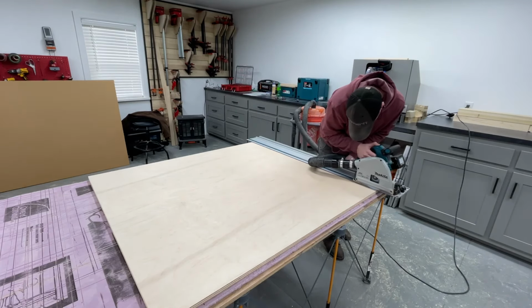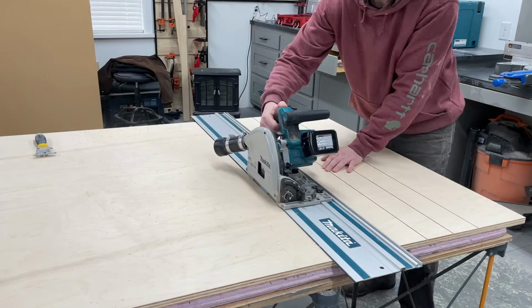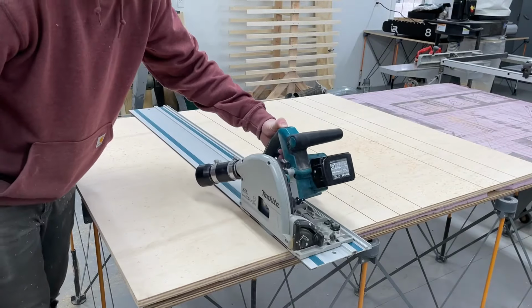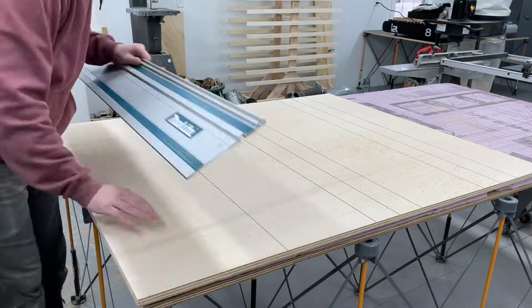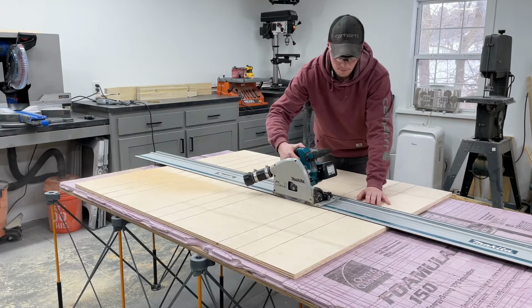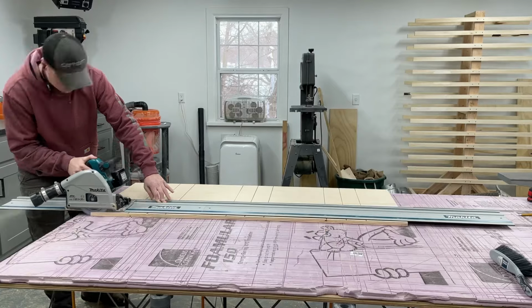I always have just built out of my head and a few numbers scratched on paper, but this is the first project where I made plans for you guys beforehand and actually used the plans myself. It was definitely nice laying these out on the computer and only cutting the necessary grooves for the final look after trim. Once the grooves were done, I then went ahead and cut the 2 panels to final size.